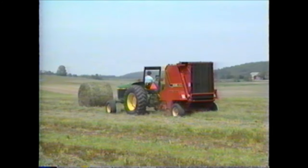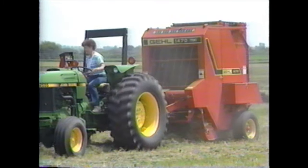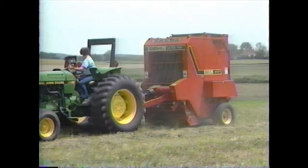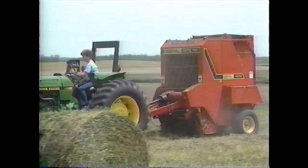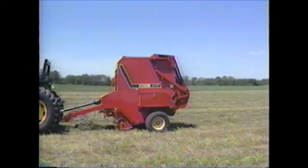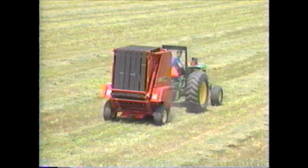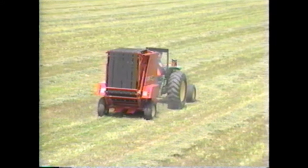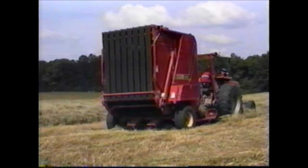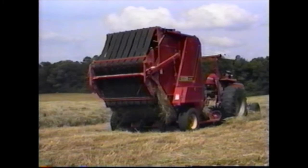Either way, you have unmatched versatility and control in building uniform bales that stand up to weather, hold their shape, and retain more valuable nutrients. Available in two sizes, Gale Total Density Control balers are built with performance and convenience features. The smaller model builds bales up to five feet in diameter, 45 inches wide, averaging up to 1,000 pounds, requiring a tractor with a minimum of just 40 horsepower. The larger model builds bales up to six feet in diameter, just over five feet wide, averaging up to 2,000 pounds, requiring a tractor of at least 50 horsepower.